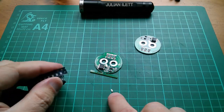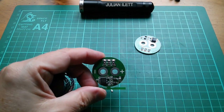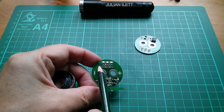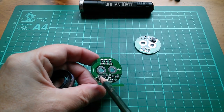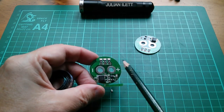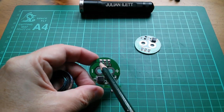We need one of these little blue LEDs. These have a little arrow — the pointy end is the cathode, so that will go to the most negative point on the board. The anode will go to positive. The cathode goes to what they call negative, routed through the drain of the MOSFET, down through the source and into the negative pin. So when this MOSFET switches on, there'll be current flowing through these resistors and a voltage across them — that's when the LED will turn on.